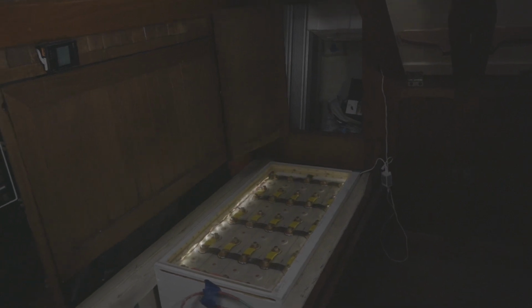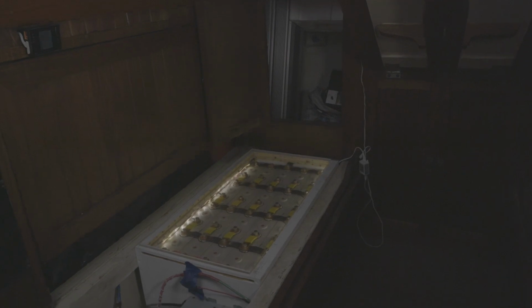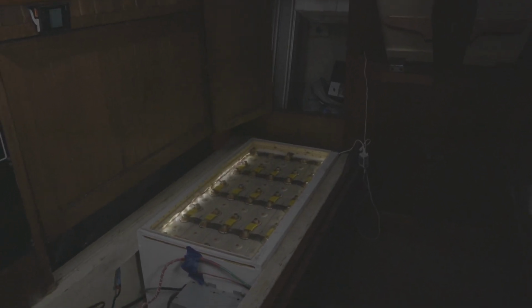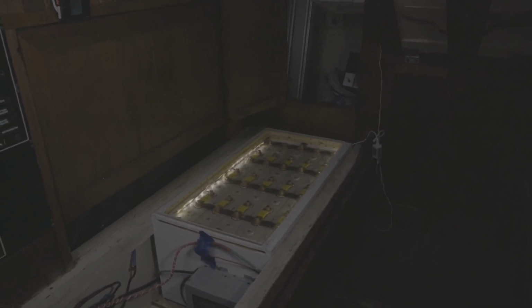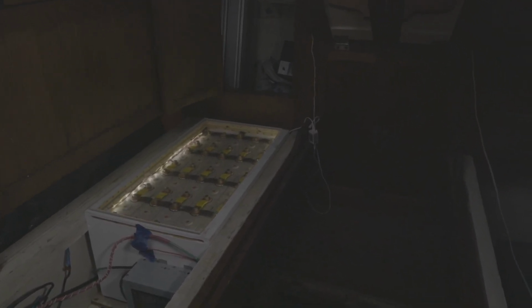And it's really interesting, but I bottom balanced these batteries, and I put them all in parallel, every cell, all of them at the same time, all connected in parallel. I ran them down to about as low, to the lowest level that is safe, around 2.5 volts. You don't want to go below that. And so I discharged them all down to 2.5 volts. Then I connected them all in parallel and let them set for literally like a week. They probably didn't have to sit that long, but that makes all of them the same level. They're all the same. And that's called bottom balancing.